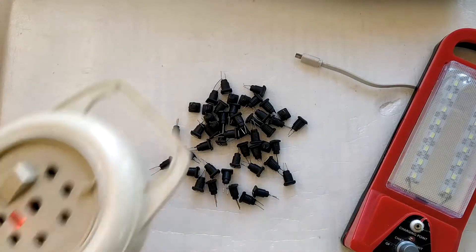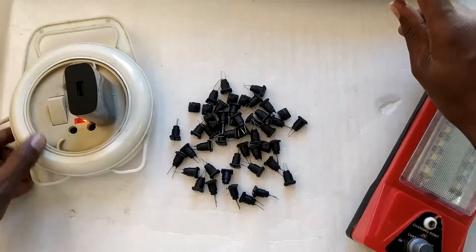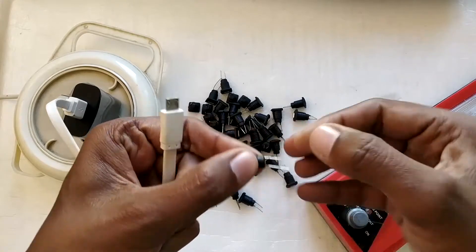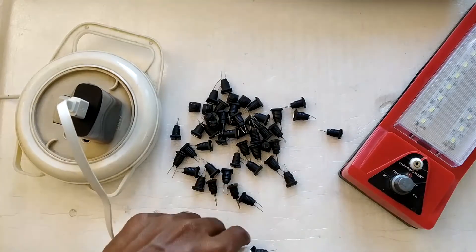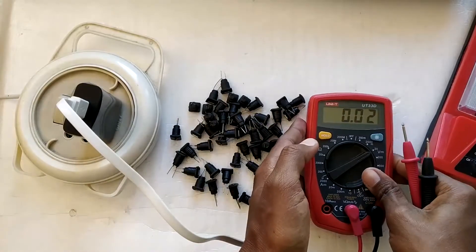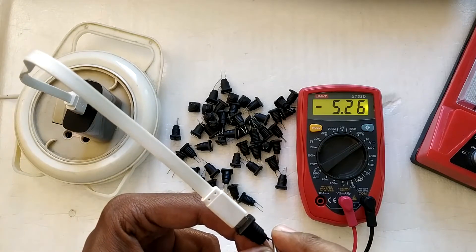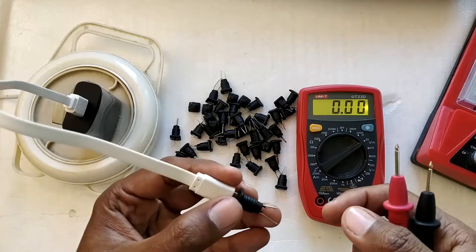Let's test these connectors. I've got an extension here — I'll plug in my Redmi Note 7 5-volt 2-amp charger, connect a micro USB cable, and use one of these connectors. There are two pins. Once connected, let's grab a multimeter, set it to the 20-volt setting, and measure. The bigger pin gives us positive 5 volts and the other is ground — we are getting 5 volts. If I solder two wires on these connectors I can run anything that takes 5 volts.